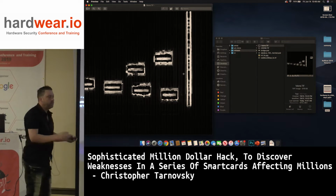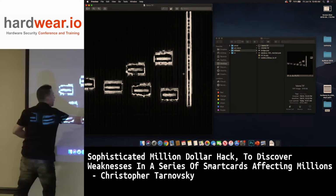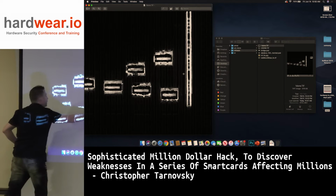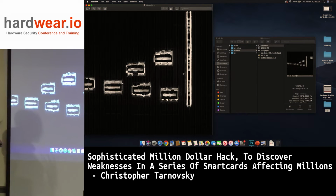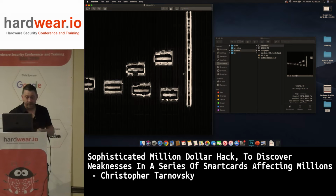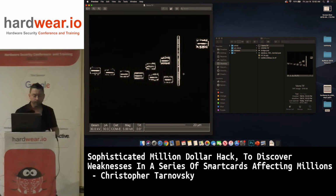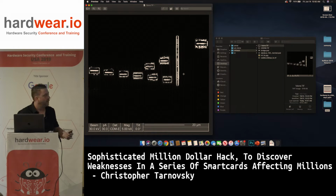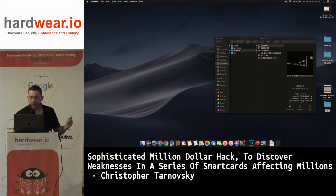So, I'll move on the FIB. I'll move over to here, and then I'll move so many microns here, make my hole. Move, go to that wire, move over here to make that hole. So this takes, like I said, about 6 hours. It's a long process. So if you were renting time on a machine, I don't think you'd be successful. This is a very difficult edit because of the plate of metal, the shield removal and stuff. But if the chip even knows we broke the shield like I did, it's going to lock up.